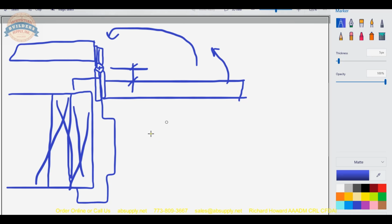Now in this case, I'll tell you what best practice would be. This same hinge, 4.5, but best practice would be 4-inch. Suck this back up towards the face of the jamb an additional 1/4 inch. It's a smarter look, it is a cleaner look, it is a more efficient hinge when it comes to carrying the load of the door.